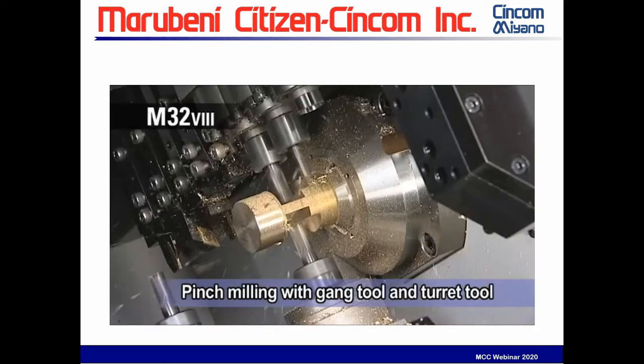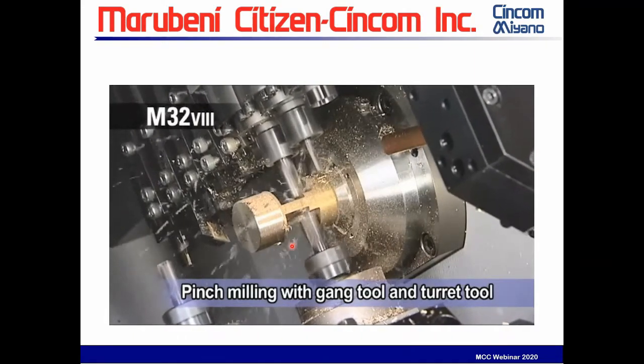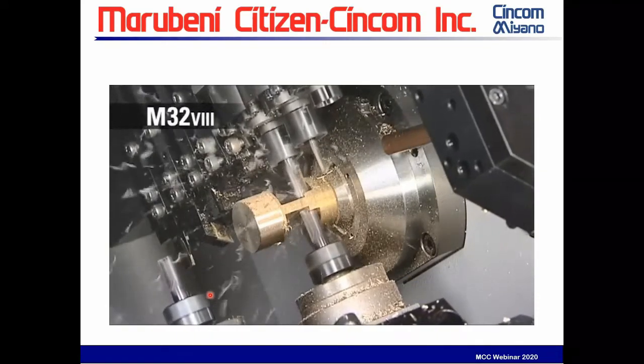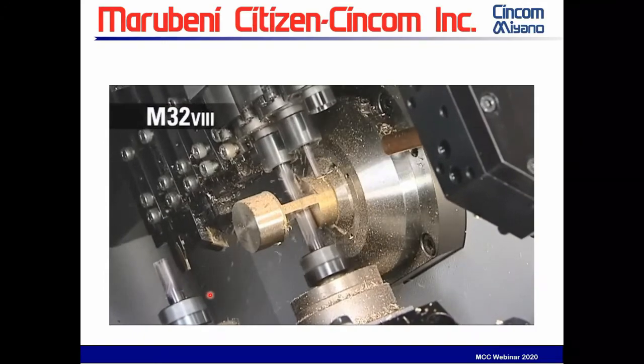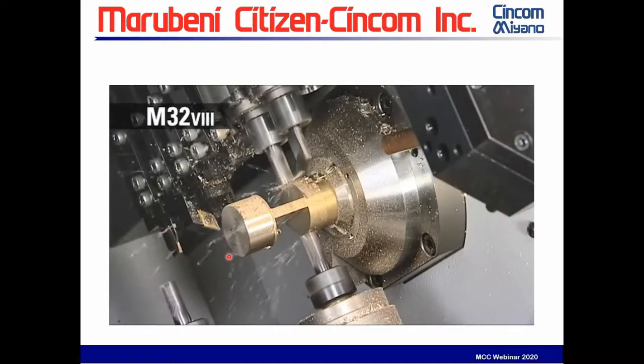One of the capabilities of the machine now, which is nice, is the ability to truly pinch turn, where you've got the same offset off your guide bushing, off the turret and the gang slide. This is done not with a shifted tool, but with a programmed shift, because you can do true pinch milling with this.